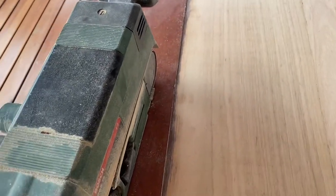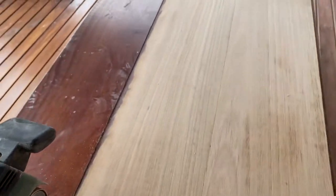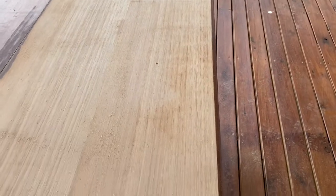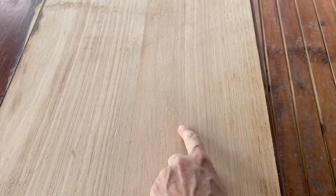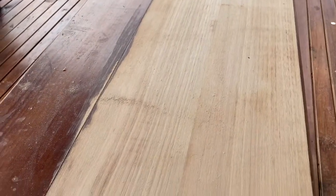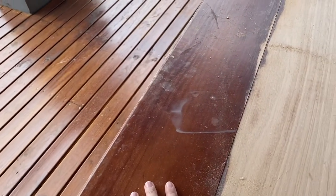This one is going to be much more difficult - there is quite a lip here where that's lifted over time because it is an old item of furniture. I want to point out as well: I am going with the grain, it gives it a smoother finish. You can see just here I lost concentration for a second and the sander went against the grain, so I'm going to have to sand over that as well. Those things happen. The best thing about having a solid timber tabletop is that I can just keep sanding it until I get a nice perfect finish because it's an inch thick.